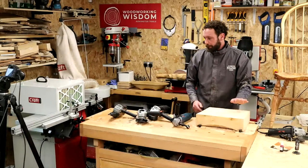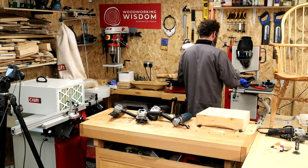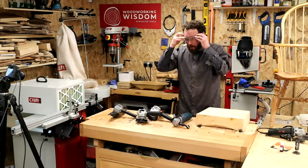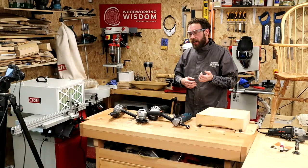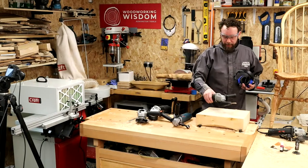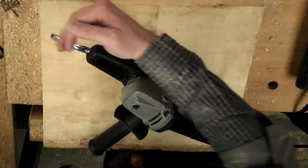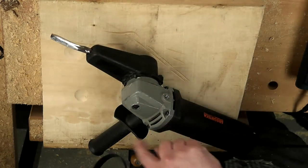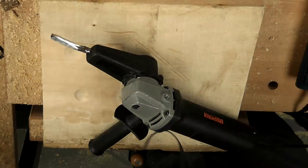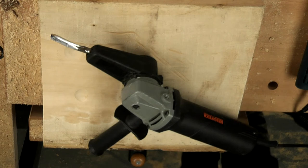All right. I don't need my full visor this time. I can go with goggles, but I will use hearing protection because it is working on a slim body grinder again. This is the power chisel, and this one has got a reciprocating head, but it works off a cam. So it's rotary steel down here, and that's just driving an arm up and down here. And it doesn't actually engage until you put pressure on it. So it's a really cool tool.